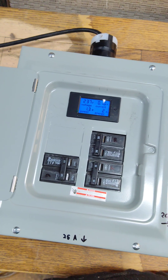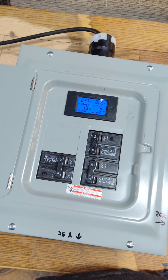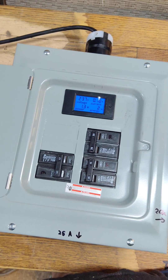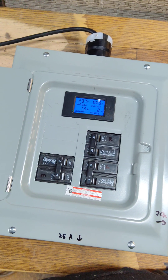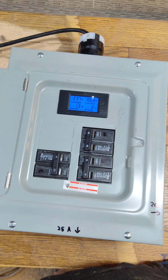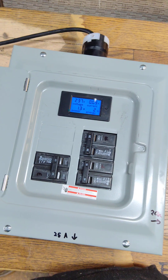All units are made to order. We can do these in three-wire and four-wire setups. The four-wire setups come with a 120-volt outlet. Everything is done to code — you're not getting a ground and neutral hooked together off of me. If you want something like that, do it yourself. Here's a short rundown of how the three-wire box works.